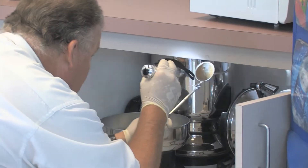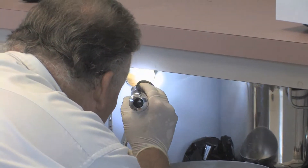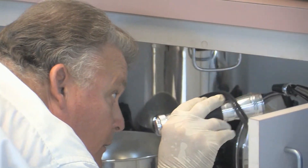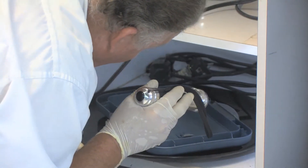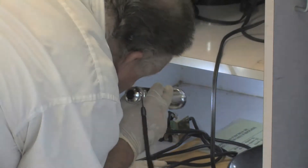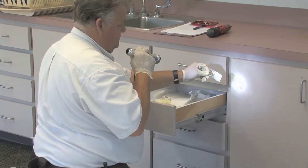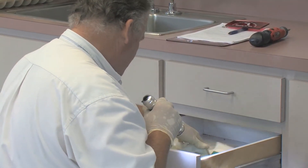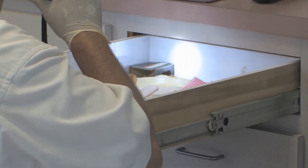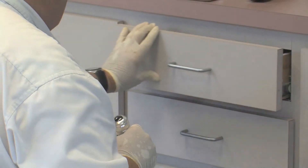You can see I'm using my mirror again here to look up underneath the front edge of the cabinet doors, because this is one of those places that a lot of guys don't look. They look to the back because it's easy to see, and they look into the bottom because they can see easily there. But up underneath that splashboard is very difficult to see. Another thing you need to make sure you do is move things in the drawers and cabinets to see what's there — open all the drawers and cabinets to determine if there's a pocket somewhere that you don't want to miss.